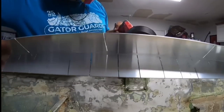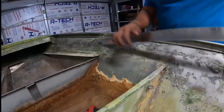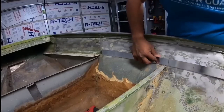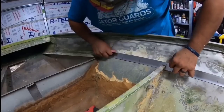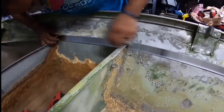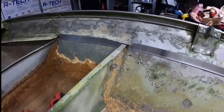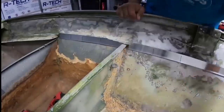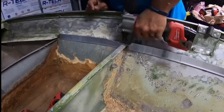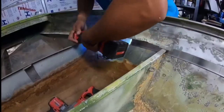But you have to groove each individual section however you need, and you need to cut them closer if you're going to try and bend to the taper. You can space them out farther if it's just farther away. I cut and slot them so I can bend them with my fingers. This is 1/16 inch aluminum. If you go to 1/8, it's impossible to bend them with your fingers, and you have to find some very odd way to flex them down, and that actually is very bad for the bend against your hull once you rivet it to the top.